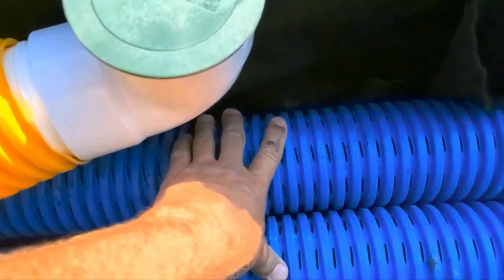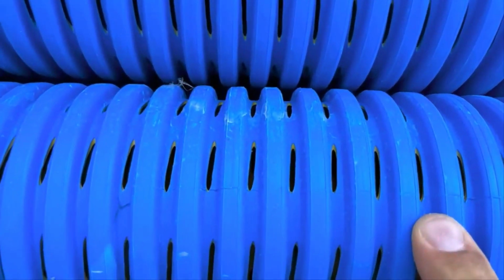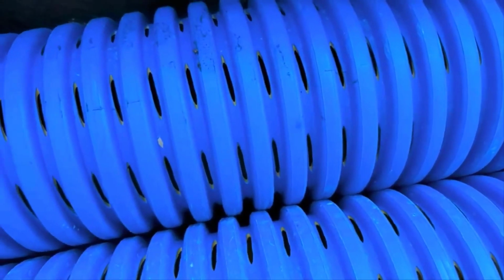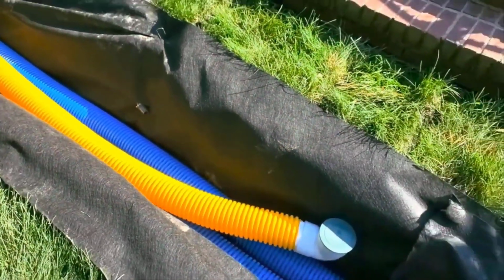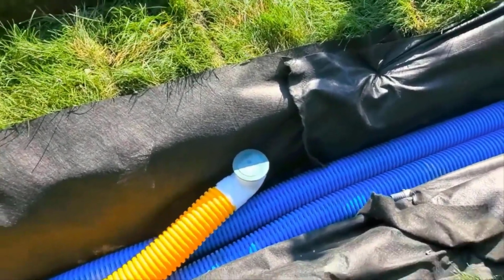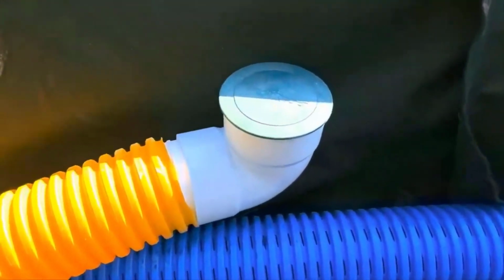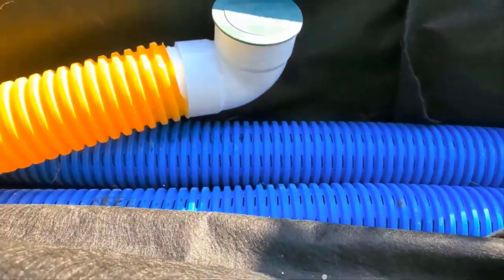So remember, this is a big void. Water just passes right through it because of these monster inlets. Also, the dirt in the stone that you buy, I love when our systems run on their very first hard rain. The reason why I love that, because the water just comes out so muddy, so dirty. And then as the system ages, the water starts coming out like it's from a mountain stream. It's clear as can be. So that's why these monster inlets for yard drains are a must.